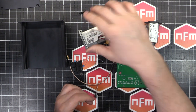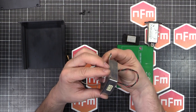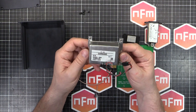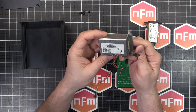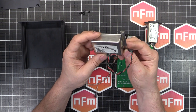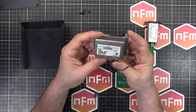I've got a module and a few other bits and pieces to get that module fired up. This module is actually - I don't know if it's from a HP device, a Hewlett-Packard device - but it is using a number of HP pieces of equipment. And it would be used with many other pieces of equipment that need a 10MHz oscillator. So it's an oven-controlled oscillator, a good 10.000000MHz.